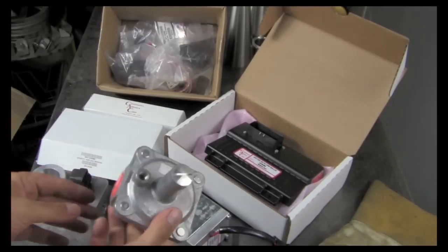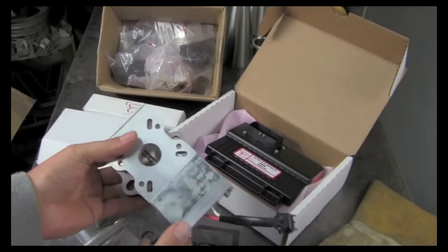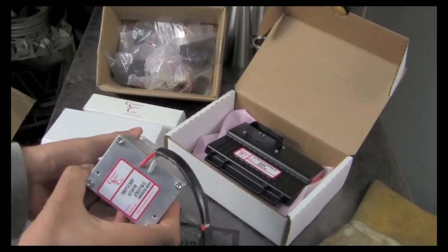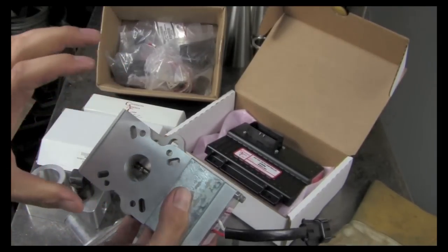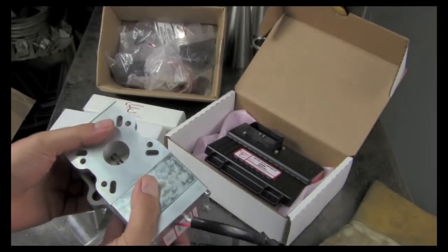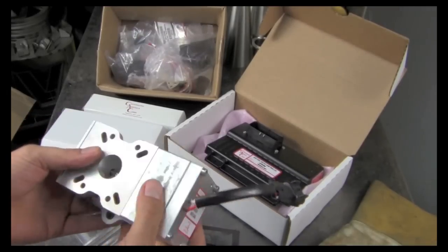All right, so this is more of our traditional off the shelf. This is a total air fuel ratio management system by Governors of America. And this is a great setup, but it's limited to the engines that they produce it for, and so it's really like a 4-cylinder 25 kilowatt Kohler genset would be the minimum for this, which isn't a bad deal.